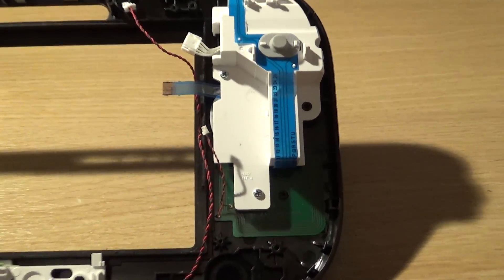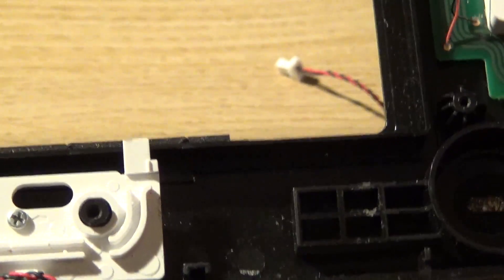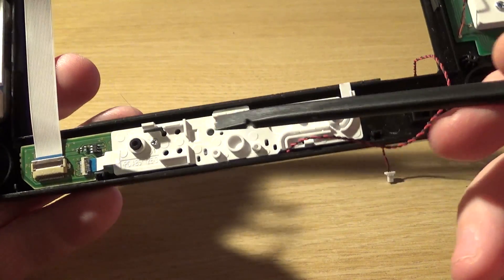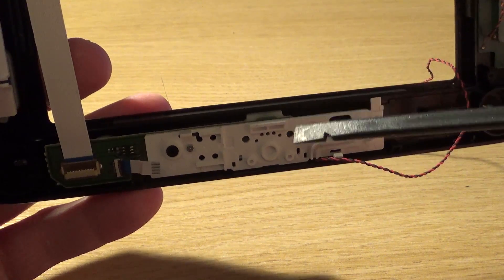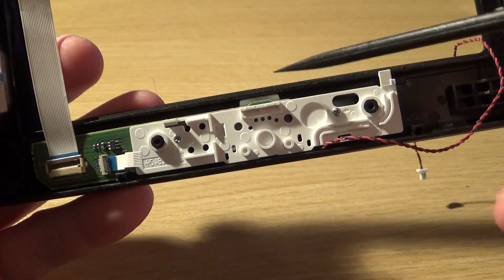In terms of PCB layout, we've also got the NFC antenna on here with its connector. That's for Amiibos — you stick your Amiibo on the front sensor and it does stuff in game. Down inside here there's a bit of PCB visible — I'm pretty sure that's the plastic membrane for the home button, so the home button is actually on that PCB down in there.